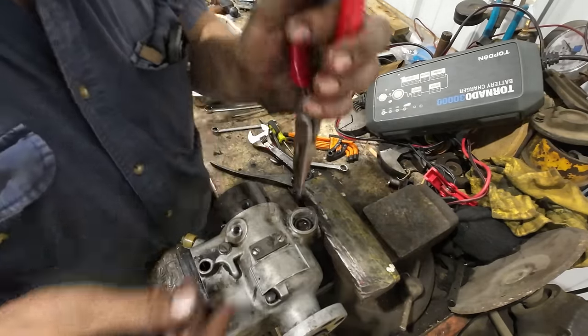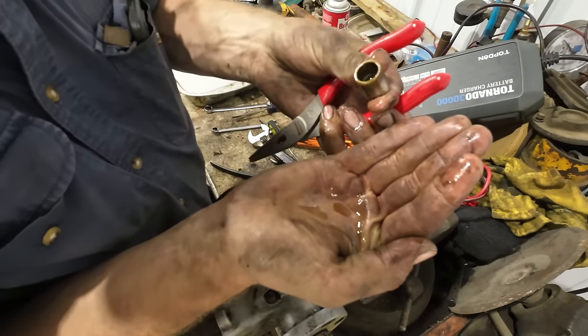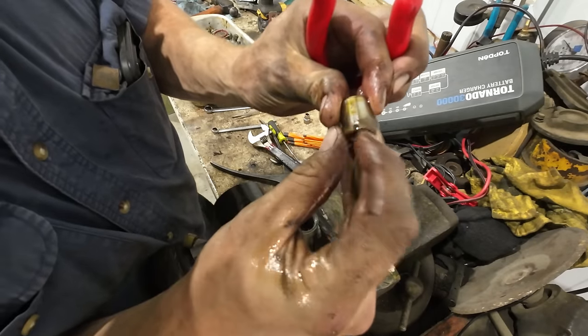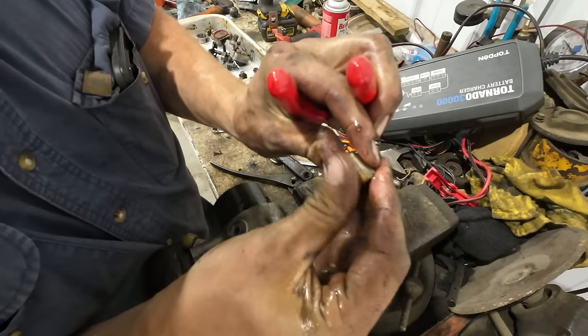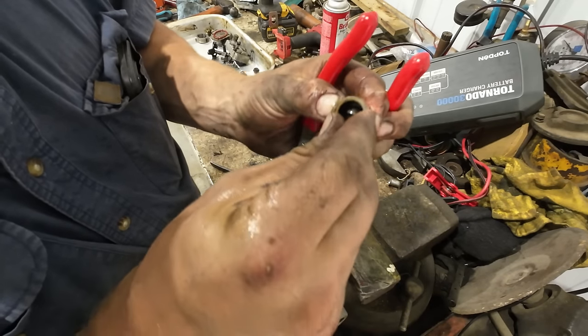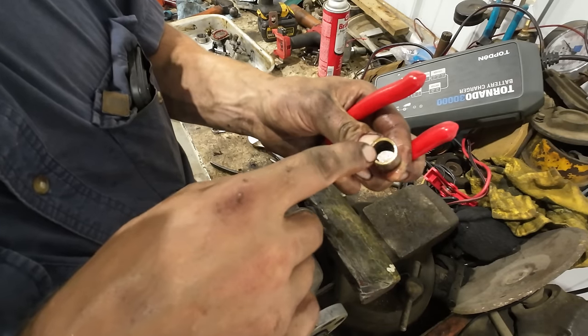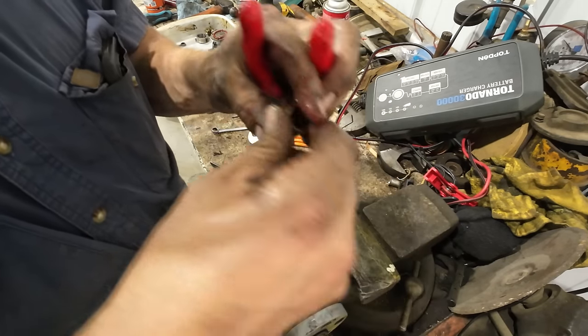See, down here in the very bottom of this pump, we're getting into dirtier and dirtier fuel. That fuel there, it's actually got some crud in it. Look at this thing. Got some corrosion and rust on it. That could have inhibited movement. Uh-oh. See? Good thing I did that over my hand. There's a little button in there. Probably changes things.